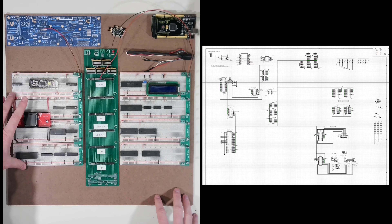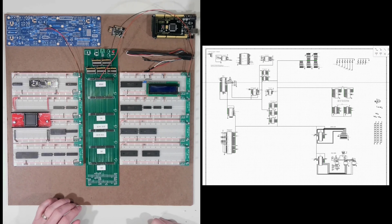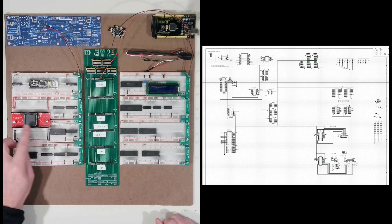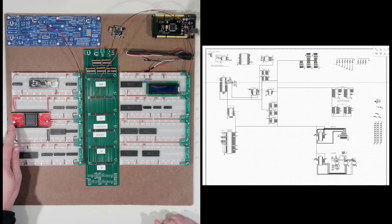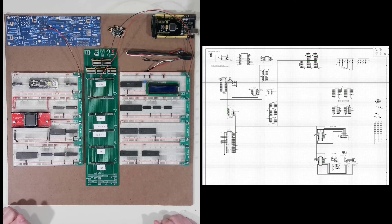At this point I have my breadboards down on a backboard. I've got a centralized bus board that I'm going to use. I've put in all of the pin headers. I have my LED bar graphs to show me the values of address and data. I have my Arduino logger mounted in the upper right. I do have the processor and an updated board that includes additional power and grounds. I am waiting on an updated hat since I had some trace issues in my design of the previous hat, but I'll add that later. I do have a placeholder up here for an updated clock and reset and power distribution board. For now I will use my existing boards — a power distribution and a clock reset board — temporarily until that new board is ready. And I have laid out all of the chips that I am going to be using.